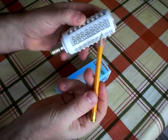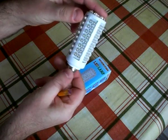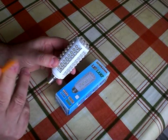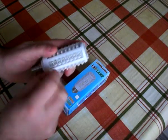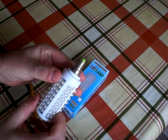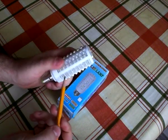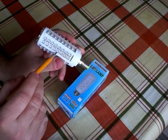This is one of them. It's got 108 LEDs in a cluster that they call a corn cob — you can see why — around a plastic body. There's a small Edison screw fitting because I bought the ones for my ceiling lamp in the lounge. The build quality doesn't actually seem brilliant. The screw thread is actually wonky — it's not aligned with the axis of the device, which doesn't bode well. There are 108 LEDs; they are standard epoxy encapsulated white LEDs, little stubby half-height ones.